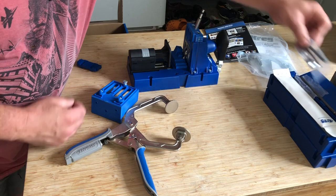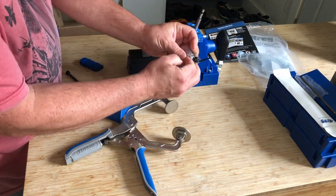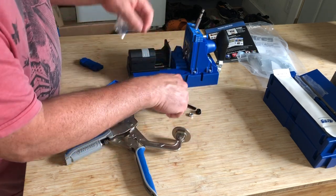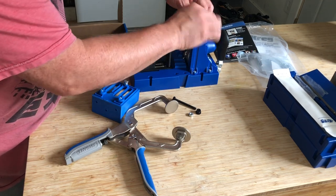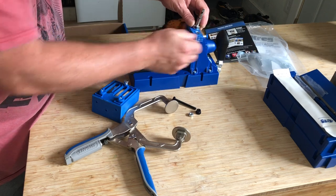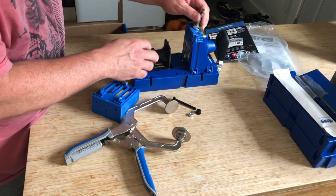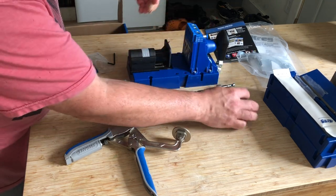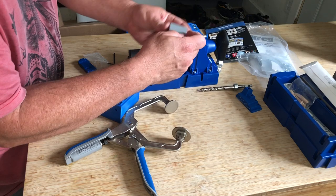So you drop the drill bit tip into the gauge, then your stop collar goes on. You take your stop collar, drop it on there, tighten it up — now that is set to three-quarter inch. Put your material in here and you are now ready to make pocket holes. That is the mystery of this setup — this is the parts you need to go with this jig.